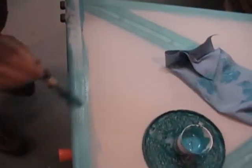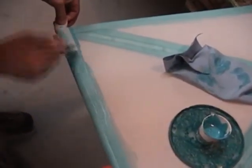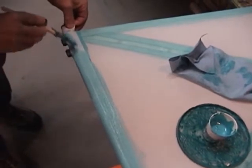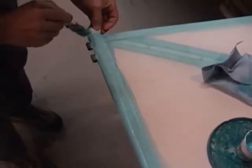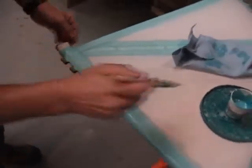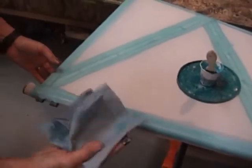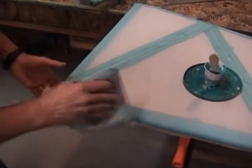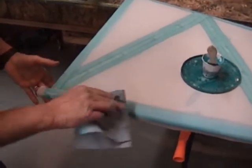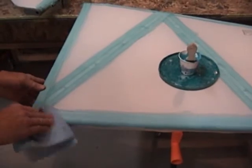You can brush it right into there. The main thing is that you don't let the glue get ahead of you — just pace your work. While we're doing our brushing and wiping, you're always working with the wet glue. I go through a lot of these towels. Once they start getting glue contamination, I get rid of them. They work best when the glue is being absorbed into the fresh towel.